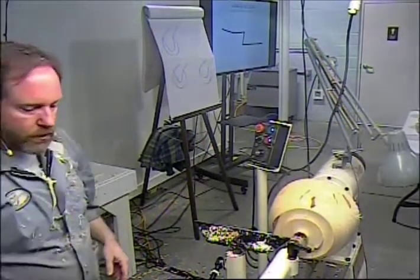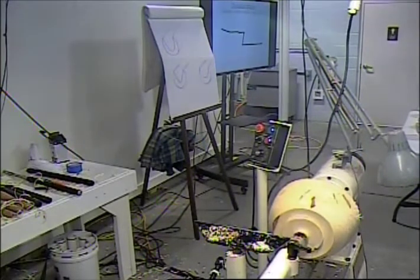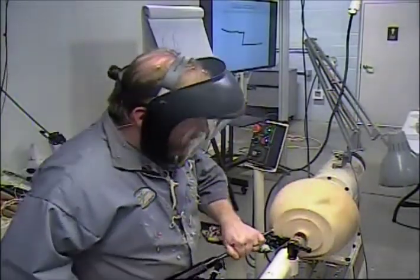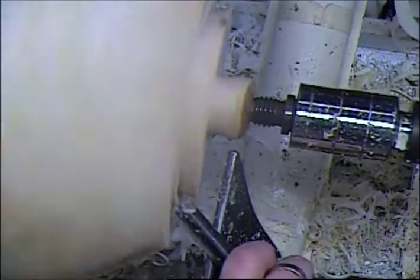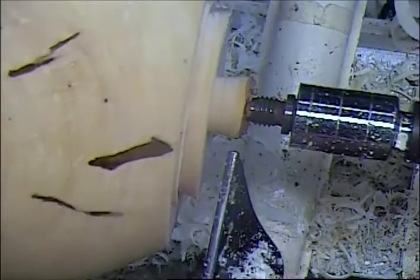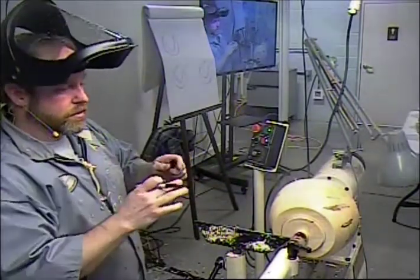Get our bowl gouge. We're going to notch this so that it looks like that. Or that. So I'm just going to step in again, and take this down until the step is just a little bit smaller than the maximum diameter of my chuck jaws. Just like that. Now, when I tighten up my chuck jaws, this high shoulder that I created will just ride along the face of my chuck jaws. So it will always maintain contact.